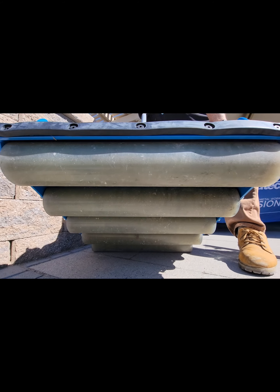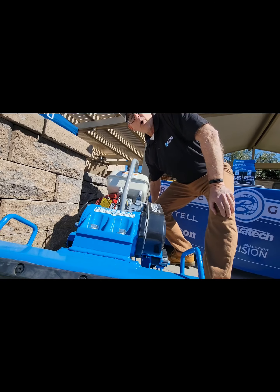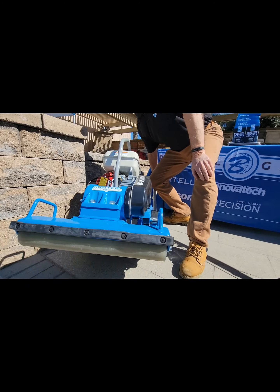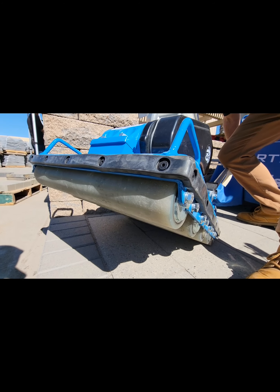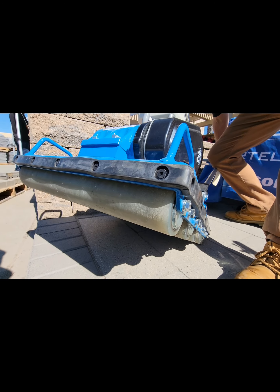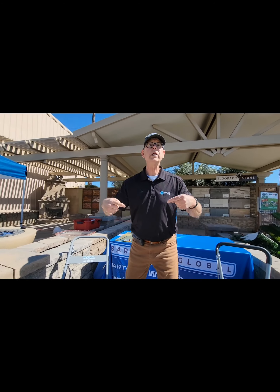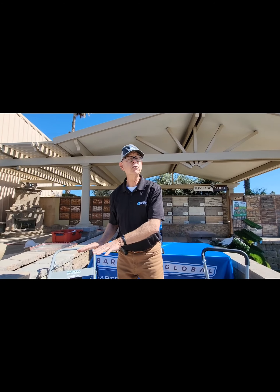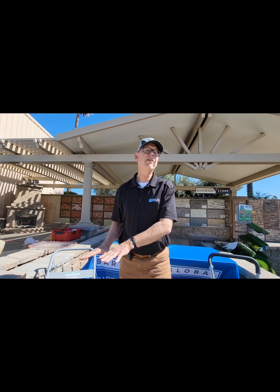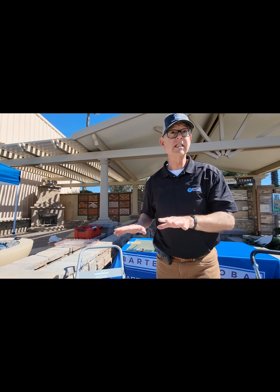The roller on the outside has a polyurethane material — even more heavy duty than the urethane mat that we normally use. That means it's not going to scratch because it's a rolling polyurethane. We're also only hitting at about 2,300 pounds — it's not enough lift for base even if you could do it. But it's wonderful for spreading that energy across the pavers and consolidating the sand.